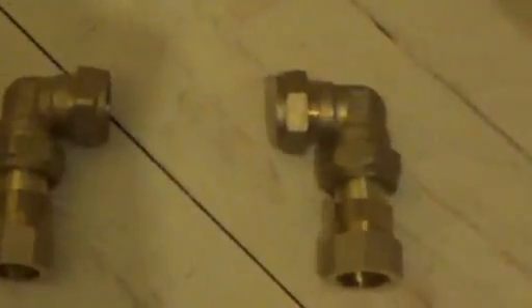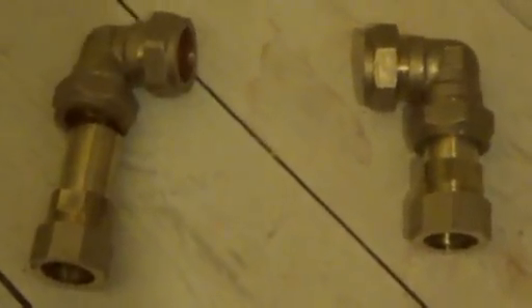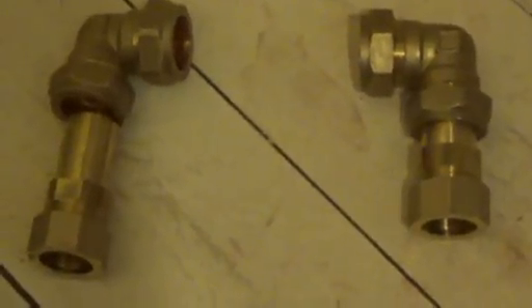At the collector on the roof, I've got two 22mm copper pipes coming out at right angles. The kit provides two elbows that connect straight onto those pipes, taking them down the roof, plus these little unions — 22mm compression fittings — where the flexible stainless steel solar pipe connects. At the top end I don't need a bleed valve because I'm purging with a pump, so that's all that's needed up there.